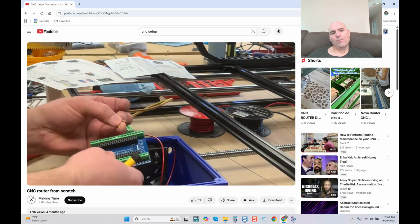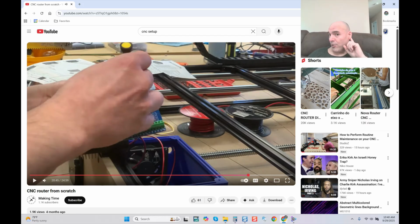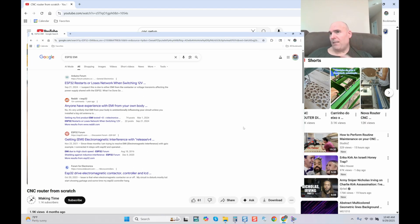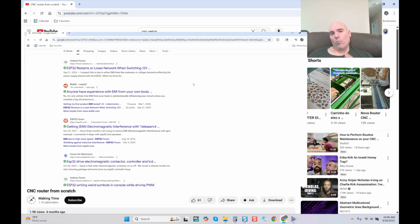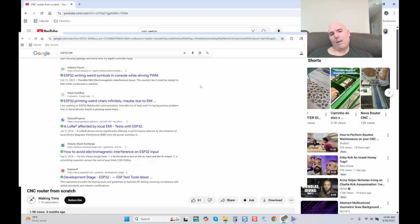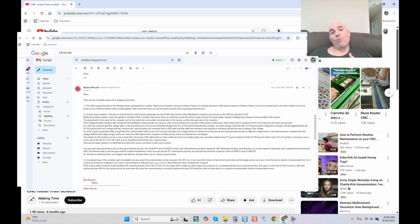That's the mounting block for the ESP32 control board I'm using. ESP32 control board, that's a USB control board. Universal serial bus. That means the signals are running on 5 volt. One more time. How do you ground that enclosure? Can't. That means that board is not grounded at all. That means we're dealing with 5 volt signals that will be easily corrupted